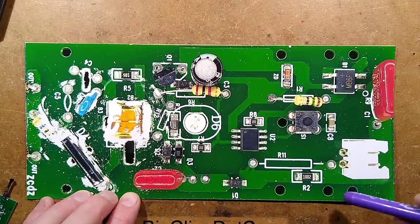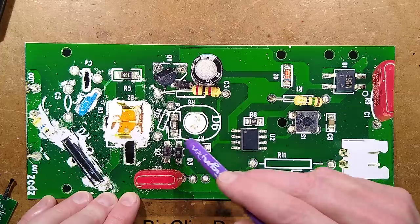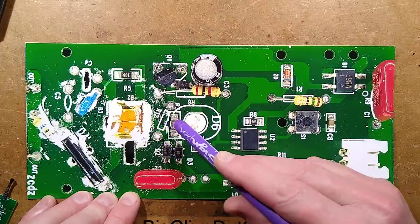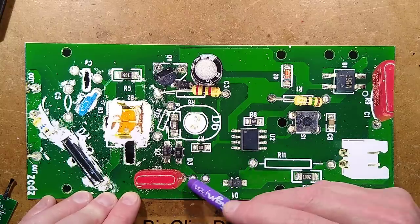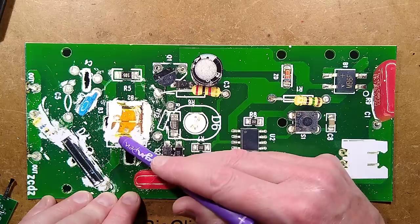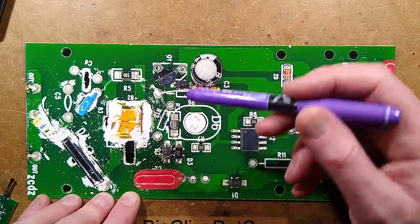The high voltage circuitry has a current limiting resistor here and one there, and they've put in the option to put a standard surface mount or through hole ones there, but they've used two 10K resistors, and then there's a half-wave rectifying diode and a capacitor that charges up, 100 nanofarad, quite high value, in series with a tiny little coil that's wrapped around the core of this two-section bobbin. They're using that quite high voltage for two sections.